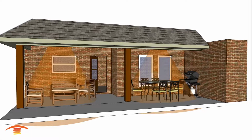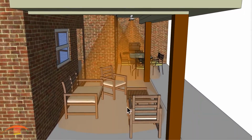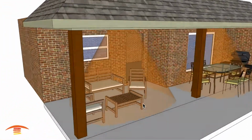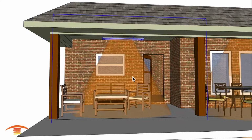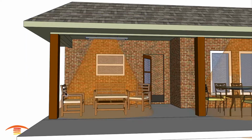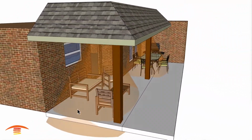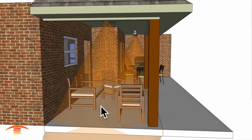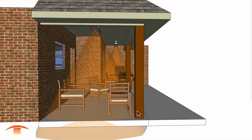And let's look at the alternative to this, which would be placing the heater in the center. But again, we're not really capturing the whole space here. We're still missing the upper torso if you're sitting right here. And of course, over here, I do have this centered again within that space. So if we were to move this over roughly maybe 24 inches, so that we're centered more between here and here, then we're getting on top of this chair a lot better. And if there are 2 seats over here, again, you'd receive better heat right below the heater than you would if it was off to the edge over here like I showed you before.